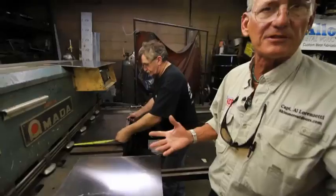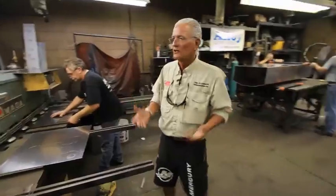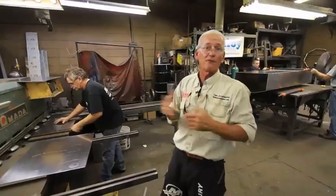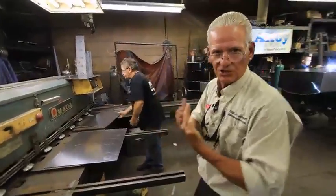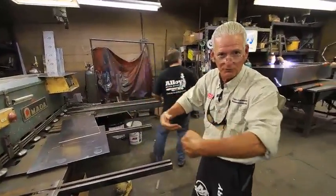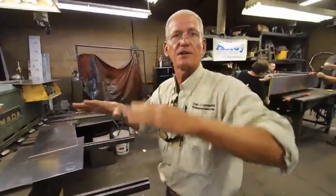So what happens if you have a big tank like this, 120 gallons, if it's half full and you start the boat, you move forward, all that gas rushes to the back very quickly and it offsets the weight and center of gravity of the boat. So they build partitions in the tank with corners cut away. So the gas will flow through those small openings, but gradually, as the boat settles on a particular angle when you're running.